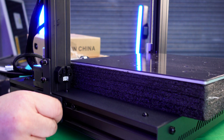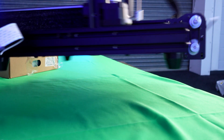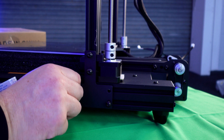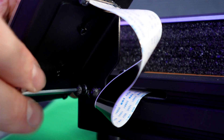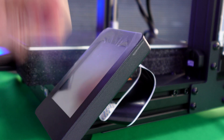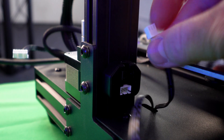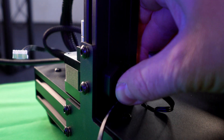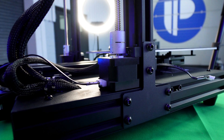The Thunder, like many hobbyist printers, requires some assembly before use — attaching four bolts to the Z-axis and two T-bars with an additional 12 bolts. The assembly process is straightforward, taking around 20 minutes. After assembling the main parts, you plug in the stepper motors and bed leveling sensor. Loading filament is simple, and the final steps include checking power settings, inserting the SD card, and leveling the bed. I found the build pretty easy as the guide covers everything you need.